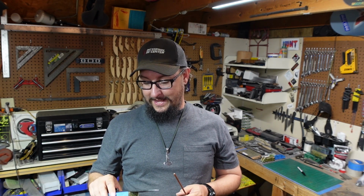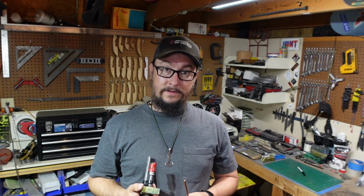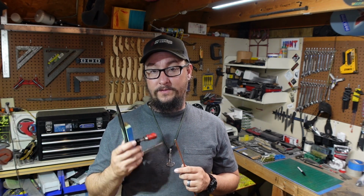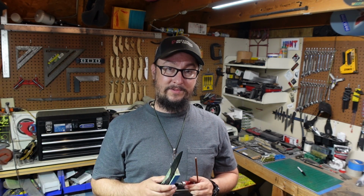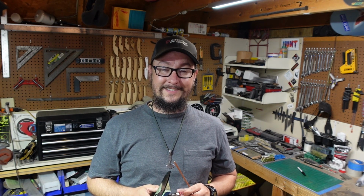Now, we're going to go ahead, get everything going. Tonight, I've got to get the scales cut down, get the front parts worked on where they're going to meet the ricasso, and get this stuff glued up to the knife. So that tomorrow, once this cures, I can go ahead, get everything shaped, and put an edge on it. So we're going to do first night's process, and get this knocked out.